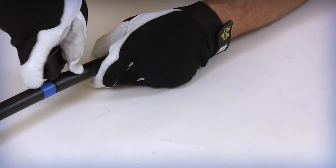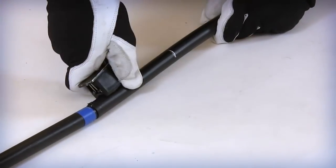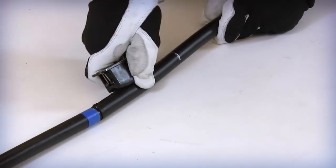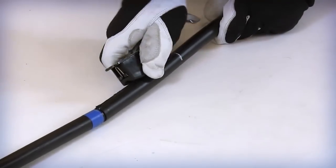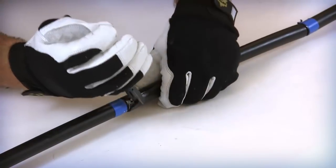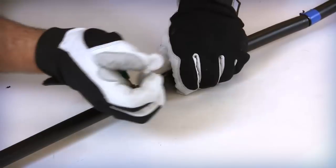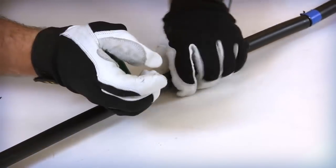Reinsert the blade beneath the outer jacket and armor. Continue to cut until an approximately 12-inch window is between the two ring cut locations. Once the outer jacket and armor has been cut, use a pair of needle nose or flat nose pliers to pry open the cable's outer jacket and armor layer approximately 5 inches.